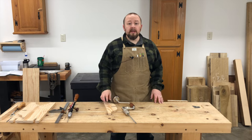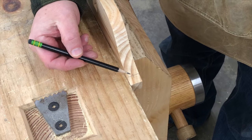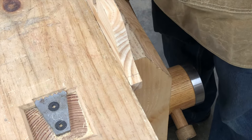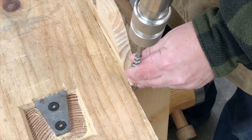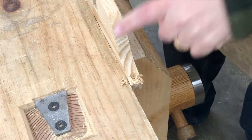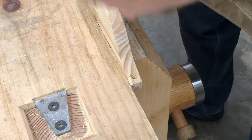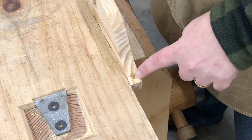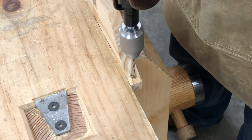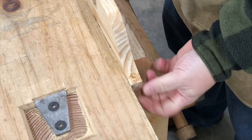The clearance and pilot holes will be bored in three different steps, starting with the largest hole for the head of the screw. I'm locating the clearance hole a half inch from the end of the stretcher and centered on the thickness of the stretcher. I'm going to use a three-eighths-inch bit to bore a very shallow hole for the head of the screw — only about three turns after that bit engages, because if I drill it too deep I run the risk that the screw head or the point of the screw could poke through the bench top. Now there is a centering hole left by the lead screw that I can drop my next bit into — the mid-sized bit that creates the clearance hole for the screw, drilled completely through the stretcher.